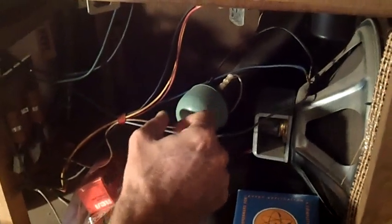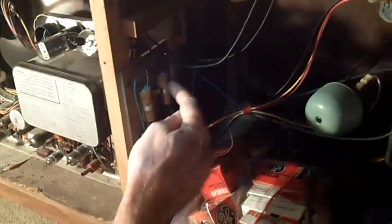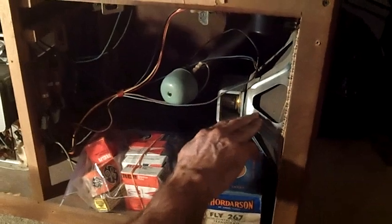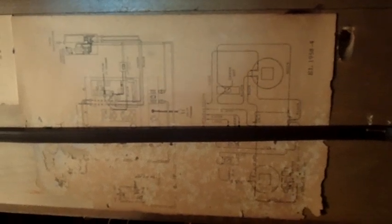It also uses a horn speaker, which is a little small metal horn disc in there that uses a horn to amplify the sound. Over here you'll see the crossover network — the crossover basically takes the signal and splits it up between higher and lower frequencies, sending the higher frequencies to the horn and the lower frequencies to the 12-inch paper cone speaker. It also has a schematic representation of the wiring for the speakers, which is fairly complex. There's a lot going on between the speaker select switch, the crossover network, the horn, and the paper cone speaker — all documented, which is very handy.